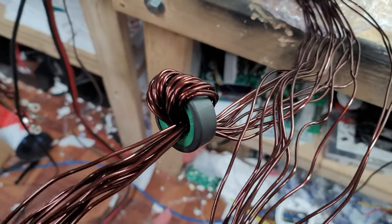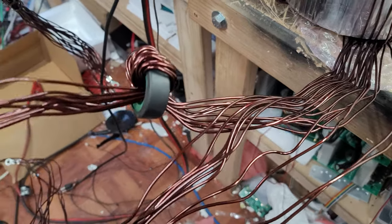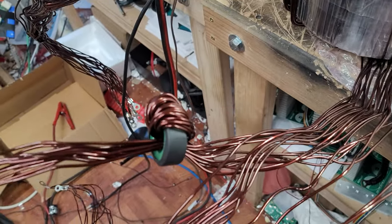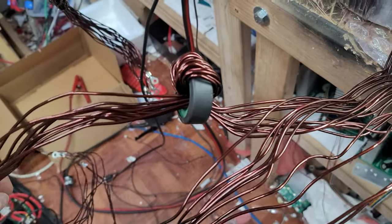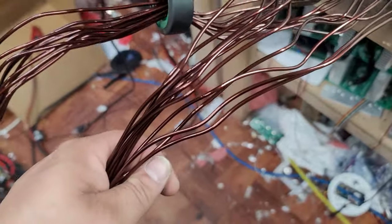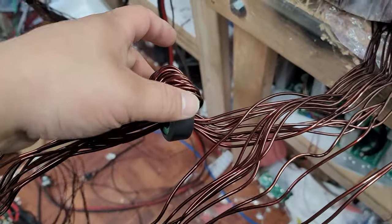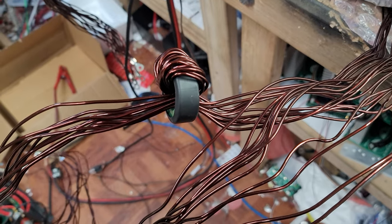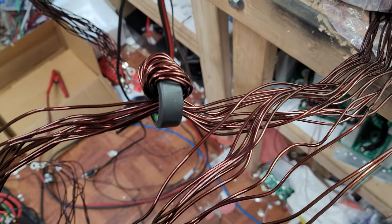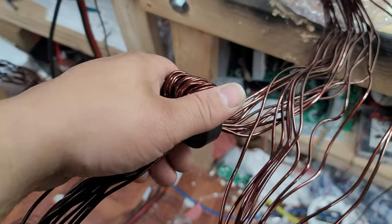My question is: what exactly is causing that choke to get really hot while the transformer itself was room temperature most of the time at idle? Number two: you can see I have just half of the windings on the negative side going through this choke. This other bundled wire is going to get its own choke. I can only fit two turns in here — Sid tried three turns and it didn't improve anything at all. Two turns seems to be the peak, and my question is: why is that?